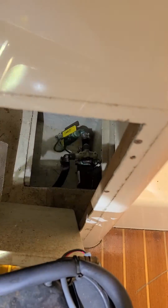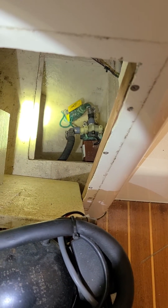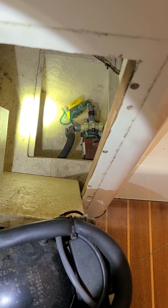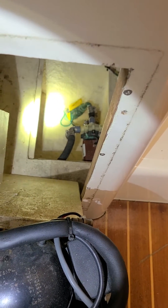All you got to do is loosen those hose clamps up a little bit and that will bleed the system. I found it best to do that, oddly enough, with it on. If you loosen it a little bit, you're not going to flood the boat, and that will remove the air lock from the system. You don't have to loosen it much — just maybe a half turn. Tighten those back up and you're good to go.